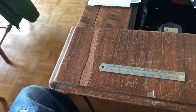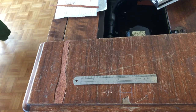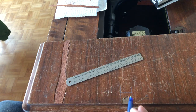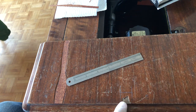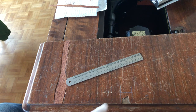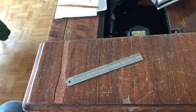I thought I would try to cut out this little shape here, so I traced over it with my paper towel. It was very tiny, and when you have a really tiny piece of veneer, it's not always easy to get results — what I ended up with is veneer crumbs. So I'm going to take the advice of one of my viewers who suggests squaring it off. I've taken this straight edge and pen and traced out almost a square from where the damaged area is. I'm going to try to get this cut without damaging it, and I'll need to lift this up and use that space to trace a square, which hopefully will be easier to cut from my new mahogany veneer.